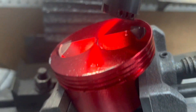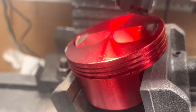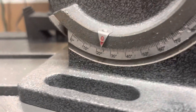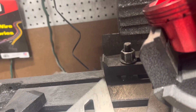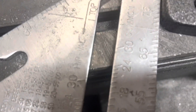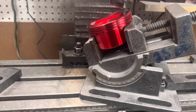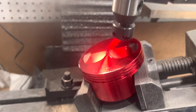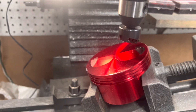That's actually a 24-degree angle — it's a compound mill cut. So it's 24 degrees up and also 24 degrees this way. As you can see, we've got this lined up at 24 degrees this way and 24 degrees up. It's a crazy angle to get that canted valve in — it's not just a straight cut or a straight angle cut, it's a mitered cut.